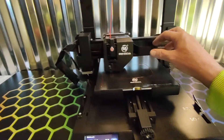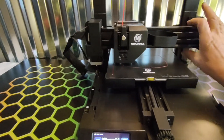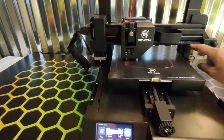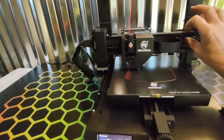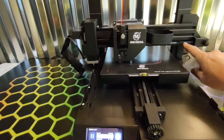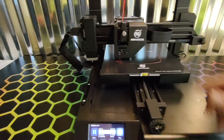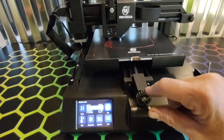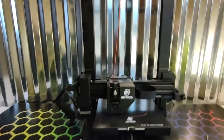This has the ribbon-style cable, which some people are starting to use again. This has a nice 20x60 X-carriage metal across it, which I definitely like better than the little 2020s. Some printers have the 2040s, but they went with a 2060 on this one. This looks like a Gates belt — I haven't seen the labeling on the belt. There are tension adjusters on both axes, and like I said, it does have the dual Z with a synchronizing belt up at the top.